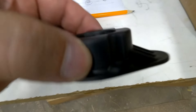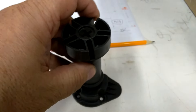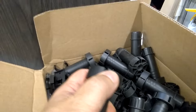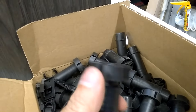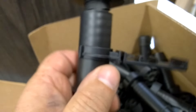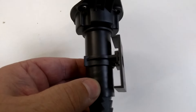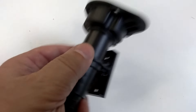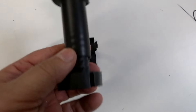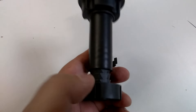This part is already screwed to the bottom of the base cabinets. You put it in and by turning you get a two-and-a-half-inch adjustment right here. You then secure and screw this to the toe kick — the bracket holds the toe kick on the front wherever it's necessary. The bracket is attached to the toe kick after the leveling adjustment.